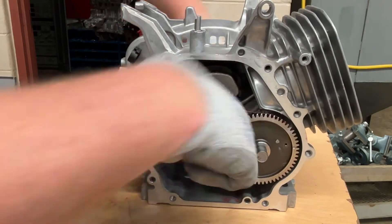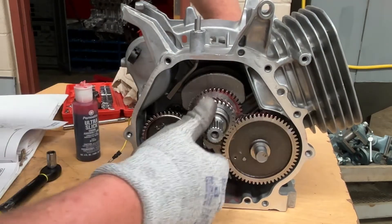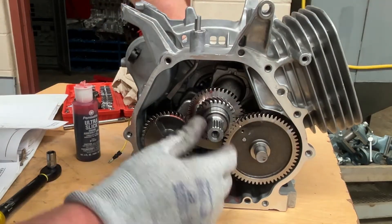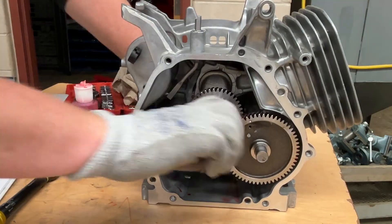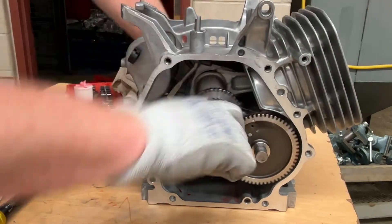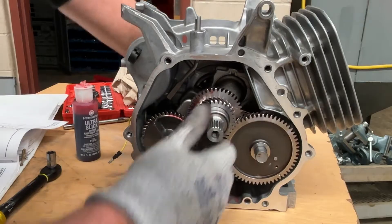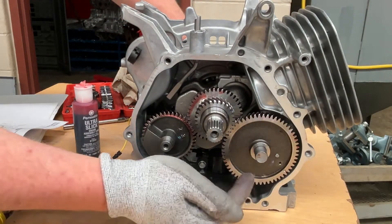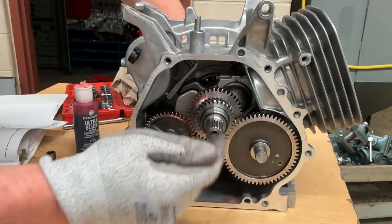I have to turn it backwards to keep these helical gears engaged, and I'm watching when this timing gear comes around again — it should hit again. If I turn forward it tends to pull that gear out and give me a problem. So timing gear comes around, looking... and right now they're opposite each other.